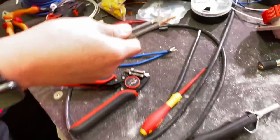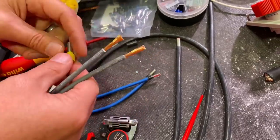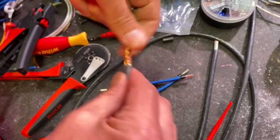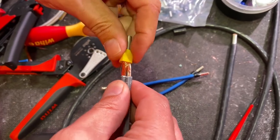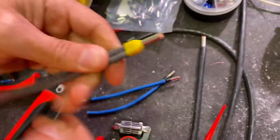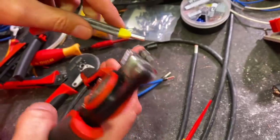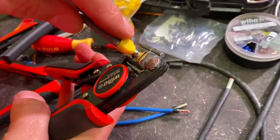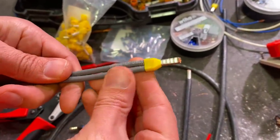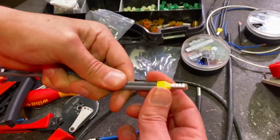Here's where contrasting colour codes come in. For twin ferrules the plastic collar is normally the same — this is a twin and it's yellow, whereas we used black before, because we've now strayed into the DIN system rather than Wiedmüller. A little gentle twist to get the conductors in, slide them down. It's a little more tricky with the double wires — you want to get them in perfectly. Two by six millimetre, just poking out the end a little bit. I want to align this square profile flat for going into a cage clamp. A bit more force — and there's our twin ferrule. That's nice. And the tug test — that isn't coming off.